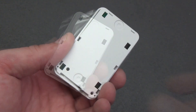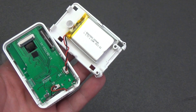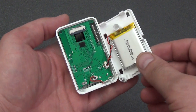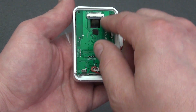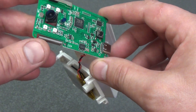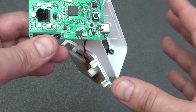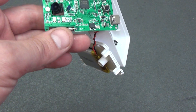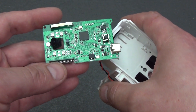However, the seller was slightly misleading about the battery — my copy has a capacity of 600 milliamp hours, not the stated 750, a difference of 150 milliamps. On the plus side, you can find higher-capacity batteries on AliExpress and install one, as the space inside the case allows. The 433 MHz antenna for pairing with the speaker module is in spring form and not soldered on the board. The main chip is the Beken BK7252DN58 — a chip with Wi-Fi, audio, video SoC, integrated MCU, codec, Wi-Fi, and Bluetooth Low Energy 4.2, supporting 802.11b/g/n, 8-bit DVP CMOS sensor, MCU up to 180 MHz, 512 KB RAM, and 4 MB SPI flash.